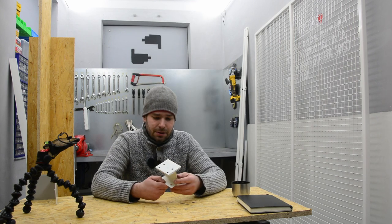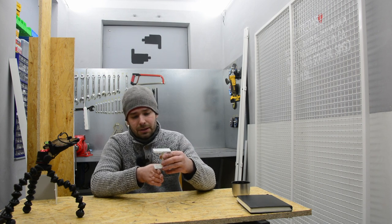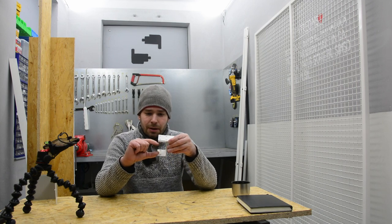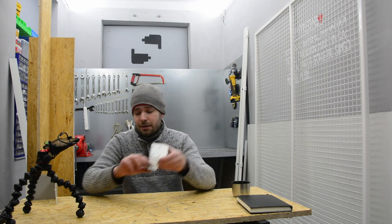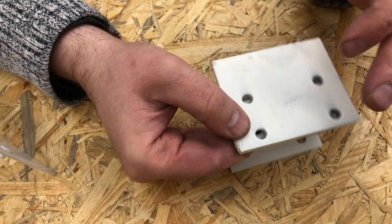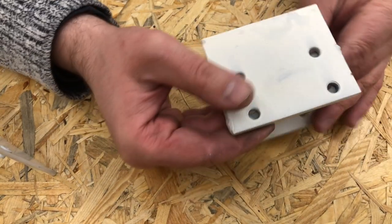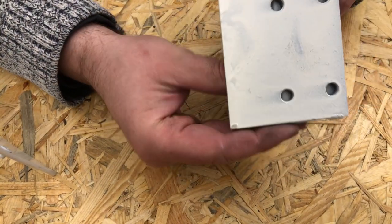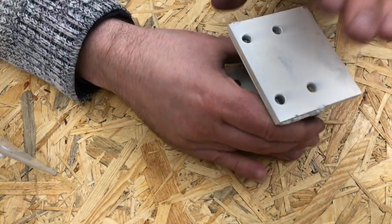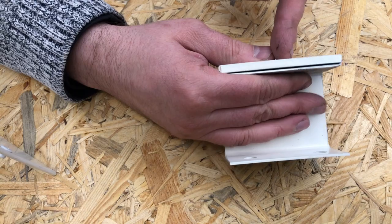This is a sort of flange which is connected to the sliding door, and it flows around the C channel in which the sliding doors are hung, and they are sliding back and forth. This one is for holding the belt. So here will be the belt, here will be the connection plate, and the lock version looks very similar.